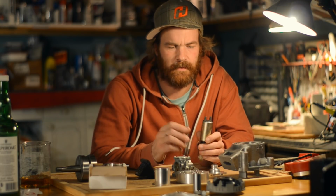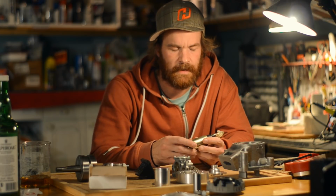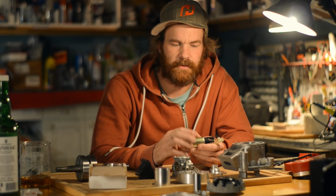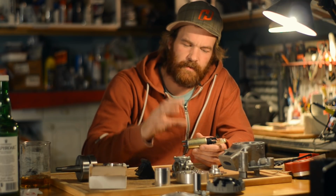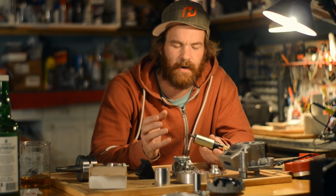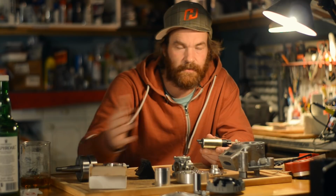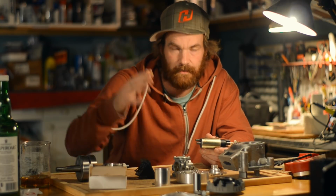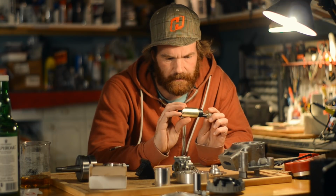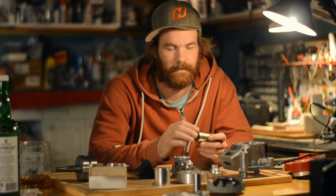And the pump will be driven by a PWM signal from an Arduino. So I will basically just throttle down the pump to deliver the right amount of fuel. So my EFI will be electronically controlled so that it can self-adjust for weather conditions and altitude. But the electronic bit of it is controlling the pump.